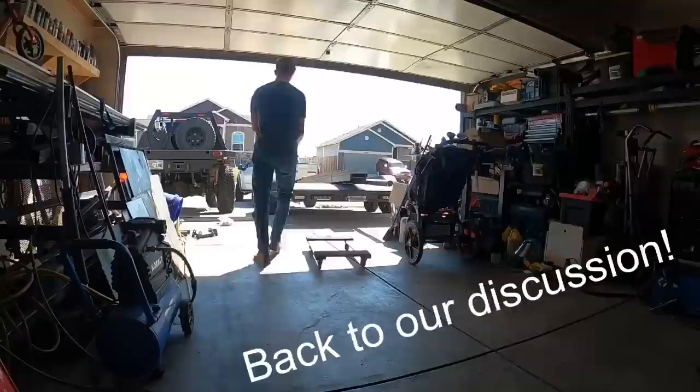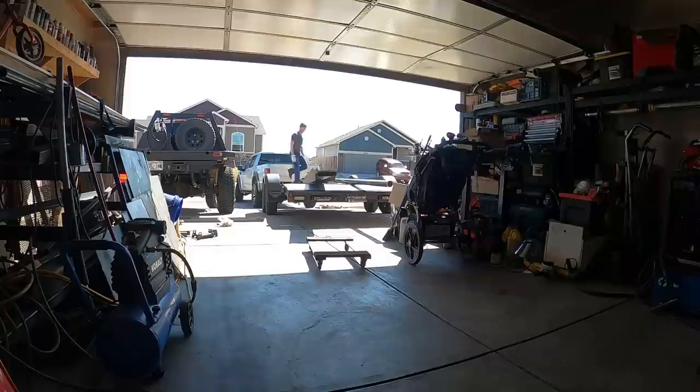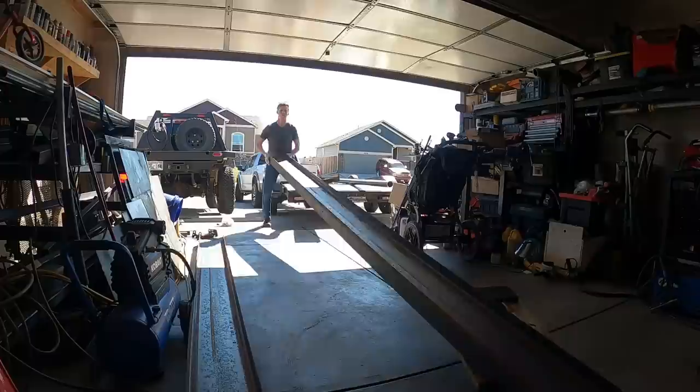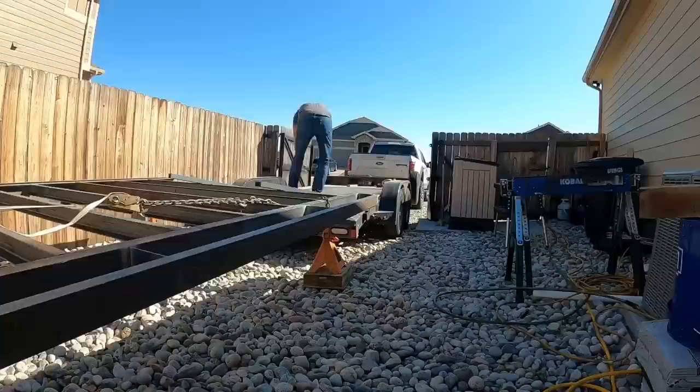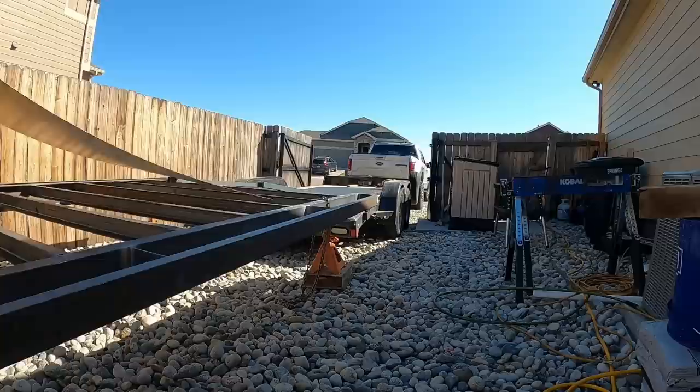And so we've got a 24-foot stick of quarter wall, 2.5 by 2.5, so it's inside of 2x2, but it's gonna have the seam. So kind of like we're having to do on the Dodge here, because I'm not gonna pay $12 for a little 4-inch piece of receiver tube when I think I got that whole 24-foot stick for like 120-ish maybe. So it's a lot of $12 receiver tubes, way more than 10 obviously. So a little bit of work involved there, not a big deal. But yep, those are some of the things that I want out of this trailer.